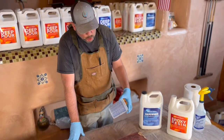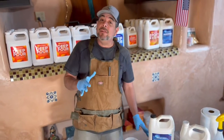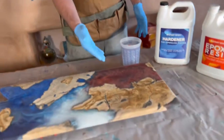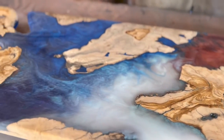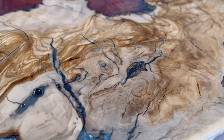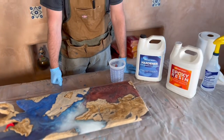What we're going to do with this is go ahead and hit it with 24 ounces, and this will be a tentative flood coat or seal coat. Just depending how it goes — sometimes you'll pour a flood coat slash seal coat that goes perfect. You don't have any bubbles, you won't get any flies landing in your coat, and everything is just flawless. In that case, we'll call it a flood coat and we're done. But if you do have little bubbles and you've got to go back and sand it and do another coat, then we'll call it a seal coat. That's kind of how we do it here.